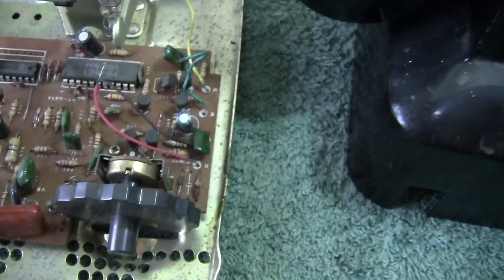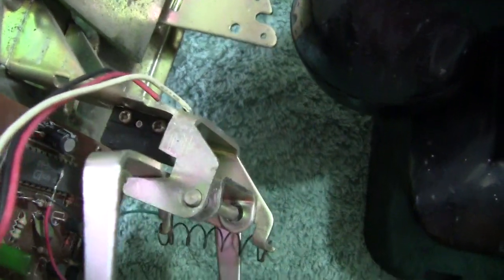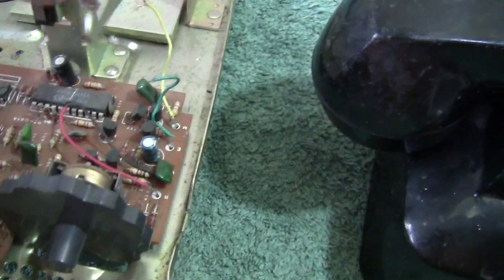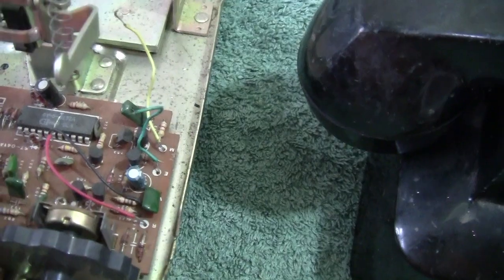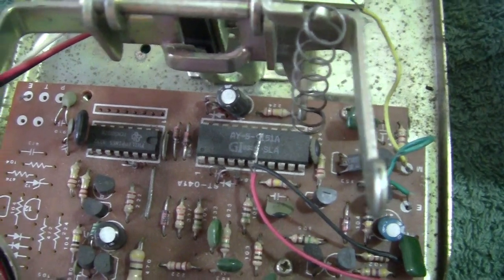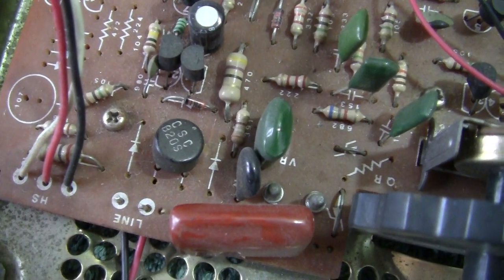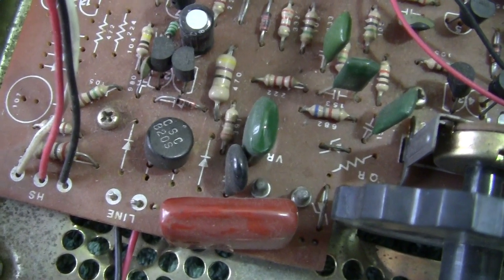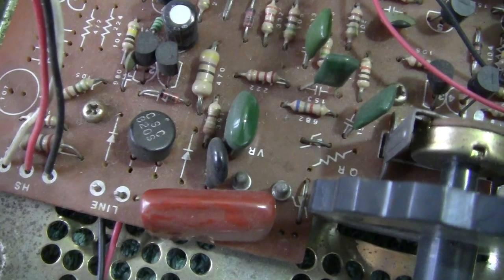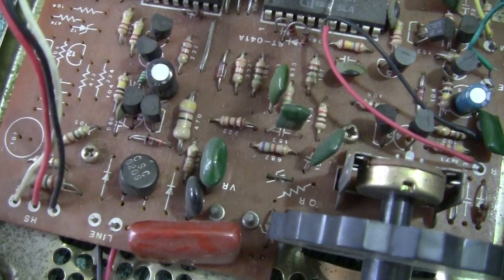The cradle switches — very crude. At the back it's got a microswitch which is wired in with a crude spring, presumably to return the cradle, which it does. There's no problem there. You've got various chips in this printed circuit board, and a little detector there which I think is used so that it doesn't matter which way around the A and B lines — or tip and ring, whatever you like — connect either way around. I think that might do polarity correction.